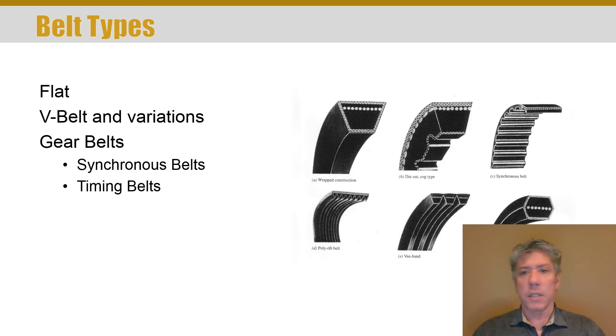There are several different belt types. V-belts are the wrapped construction type shown in figure A. Belts are made of rubber and reinforcing material — the rubber itself is very flexible and would stretch like crazy, so you have to have something to reinforce it to keep it from stretching. There's essentially a spine in the back, just like reinforcement cords in a tire. There's actually a tremendous variety of reinforcements available: Kevlar, fiberglass, and many others, each with their own strengths and weaknesses depending on the application.